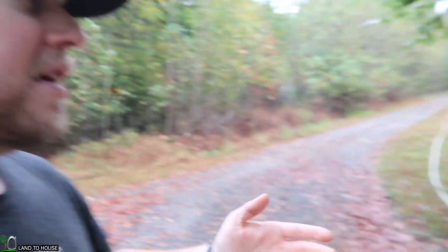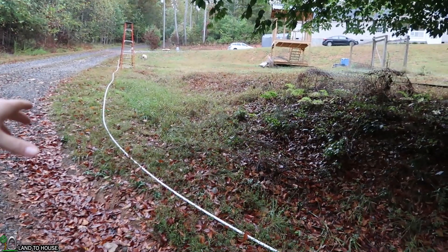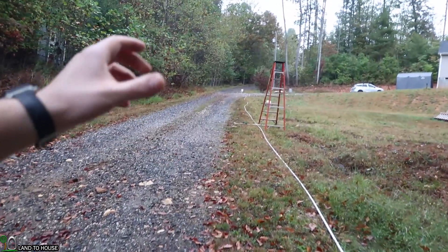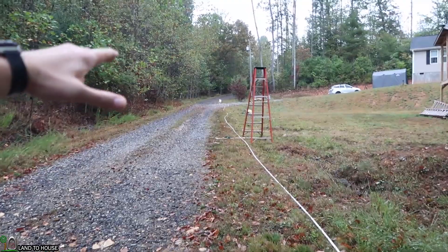You want to have the drive pipe somewhere between 25 feet and 100 feet long, but sometimes you can't gain all of the drop or head pressure that you need for a pump and then you have to go further than 100 feet. To do that it's important to install a stand pipe. This pipe sticks up in the air and matches the source water, essentially bringing the source closer down to the pump. The terminology is: drive pipe to a stand pipe and then it goes to supply line up to the source.